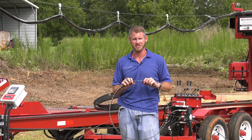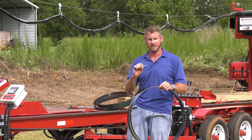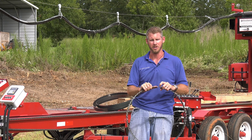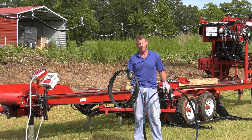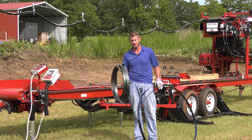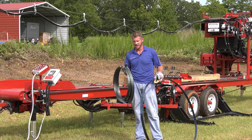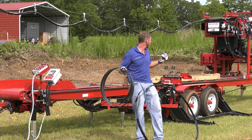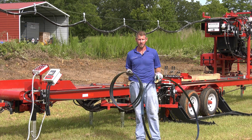Horsepower directly relates to the speed of what I'm able to cut with. The width and thickness of the inch and a half gives me more beam strength — I'm able to push it faster without getting the wave that shows up when you're pushing your blade too hard. We've got our inch and a half Dura-Tooth blade, and then we also have our two-inch blade. This one is a Magnum blade, which is going to be a little bit thicker — 55 thousandths and a little bit wider at two inches. We're going to do some videos coming up with these two blades on the mill here, so subscribe to our channel so you don't miss that.